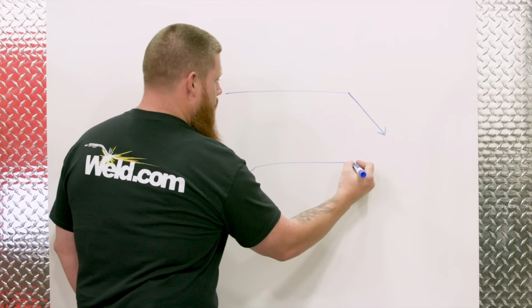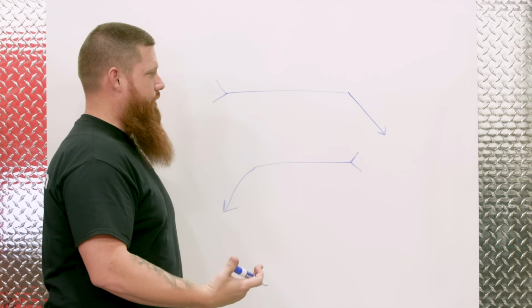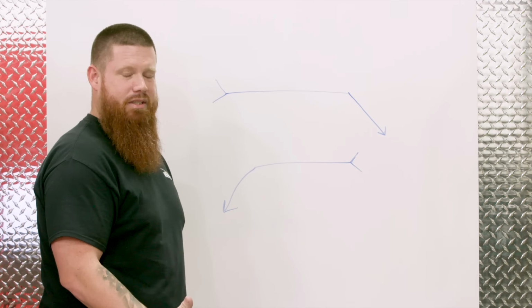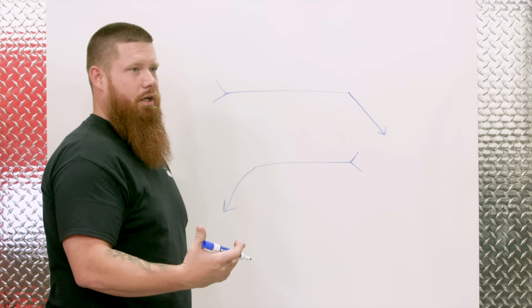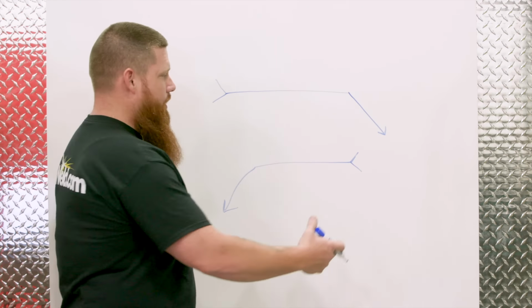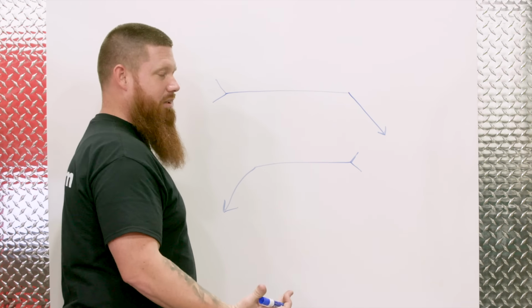If I have the information here, it's always going to go from left to right on both of these. Now sometimes we have a tail, and the tail is used to give us additional information that isn't found on the welding symbol. They don't have a weld symbol or a supplementary symbol for it, such as process or specific preparation, or when we get into talking about back welds and backing welds, because it's pretty much the same symbol, they're going to list it in that tail, the information that they don't actually have a symbol for.